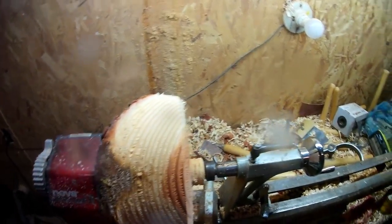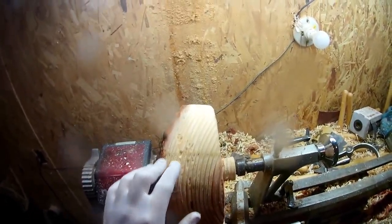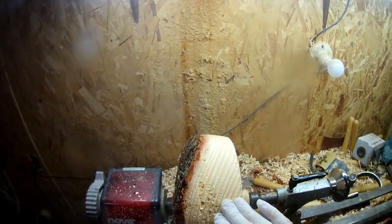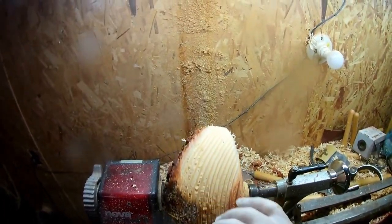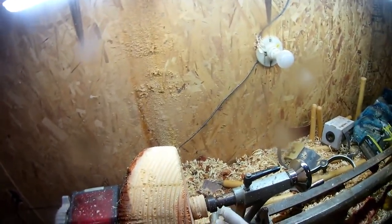You know, I'm sure this isn't the best technique, but 100% self-taught. Different techniques at work, and I found each piece of wood's different. Now this is the sapwood, obviously, off a decent little chunk of Douglas fir. Cross grain, that's one thing that's interesting, is this is almost sanded smooth right there. You get a lot of tear out here, so we'll do a whole lot of scraping, and a lot of sanding, but we're a long ways from that.